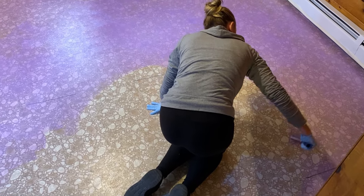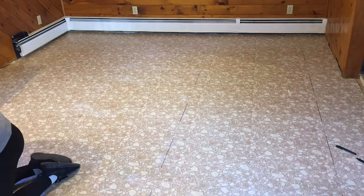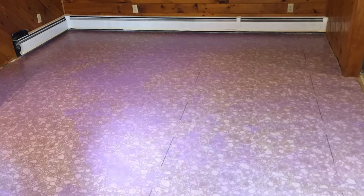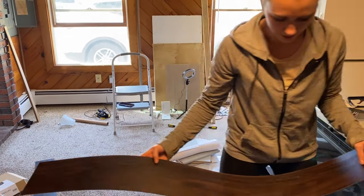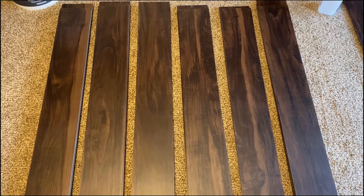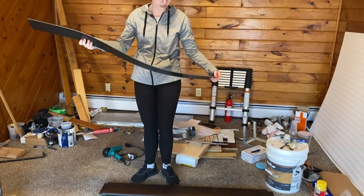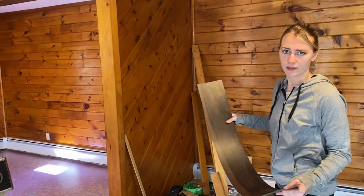Please don't glue yourself into a corner — think ahead and make sure you plan a starting and a finished location. Once the adhesive is down, you just need to let it set up before you can start laying your planks, which means letting it essentially dry a little bit. This can take anywhere from 30 minutes to two hours depending on the product and the environment. As the glue dries, it will turn more translucent and become very sticky. Once you can touch the glue without it coming off onto your finger, you're ready to start laying the floor. While waiting for the glue to set up, open several boxes of your new flooring and separate the planks into piles based on their design to prevent laying two planks of the same design too close together. Quickly inspect your boards before you put them down to make sure there are no scratches from the shipping process, because they're kind of a pain to peel up once they're stuck down.